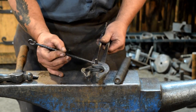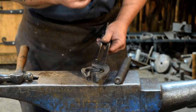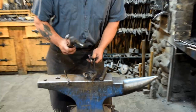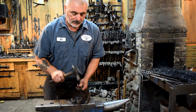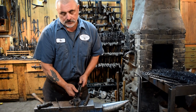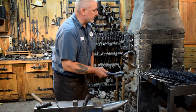We're going to need to heat this up to do the riveting process. You can heat this up locally with a torch, or in our case we're going to be using the coal forge. Before I stick it in the fire, I take my ball peen hammer and give this just a few hits to mushroom this end a little bit — that keeps the rivet from popping out. Now we turn it over to heat the end of the rivet and stick it in the forge.